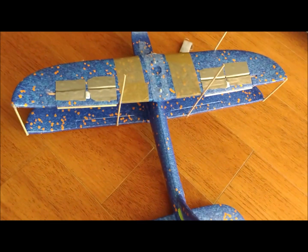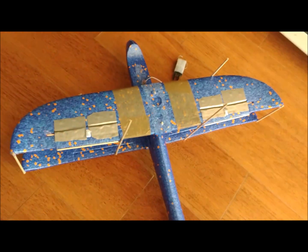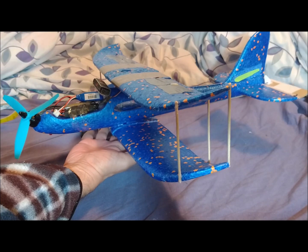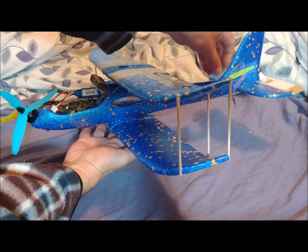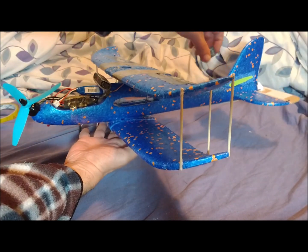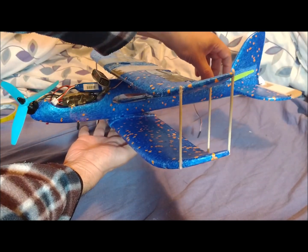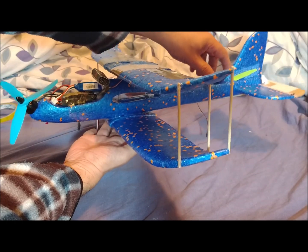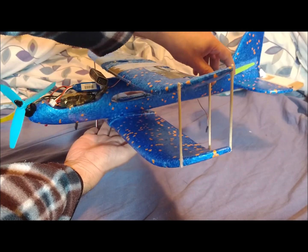To decide where we place the servo for the elevator, we add the electronic items in the longitudinal axis. We notice that, even placing the servo at a backward position, the center of gravity would be somewhat ahead of the first third of the wing chord. Therefore, we move the position of the servo backwards as much as possible, because there is a lack of weight